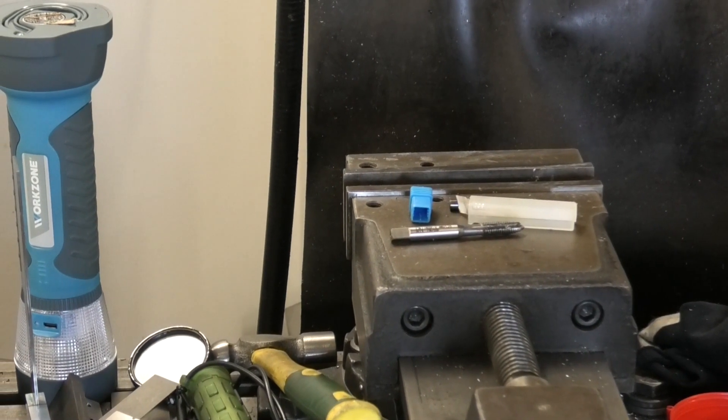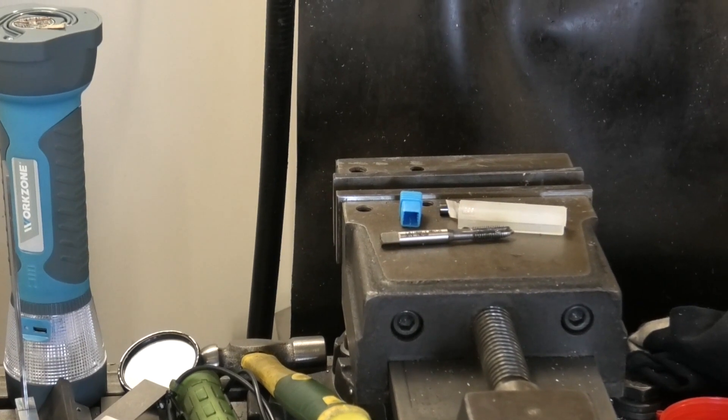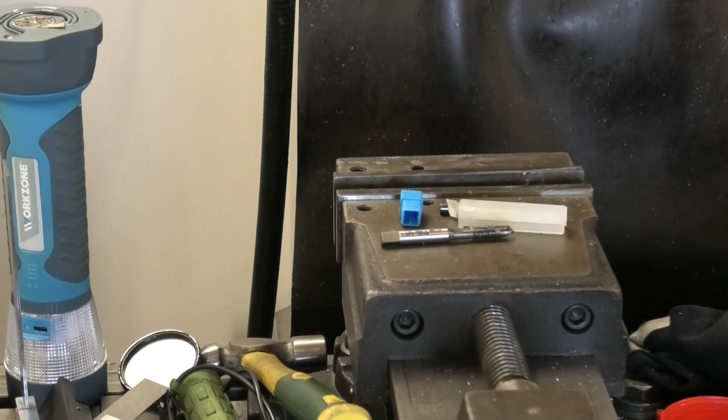Amazingly, once again a carbide drill drilling into a tap. I don't think it was high speed - I think it was a tungsten steel tap. It was reasonably hard. But a tip this time: it drilled a lot faster without lube. Bye for now, please like and subscribe, and I'll do another video in a few minutes on tool and cutter setup. Bye.